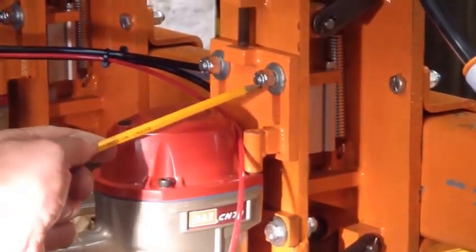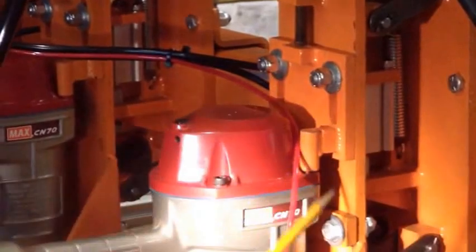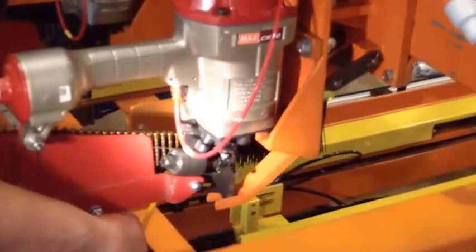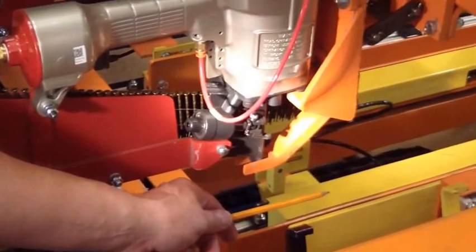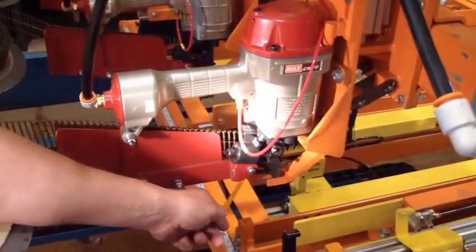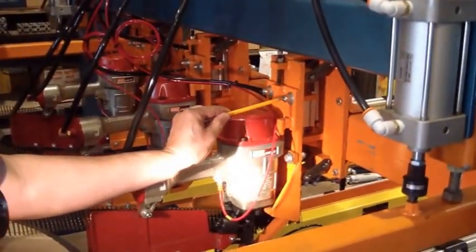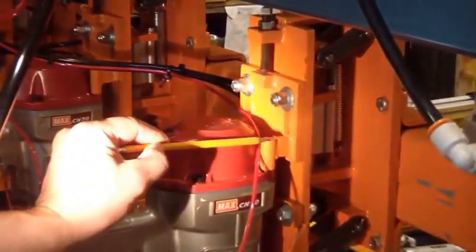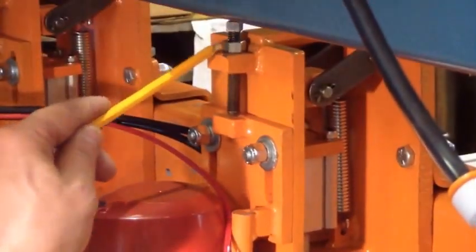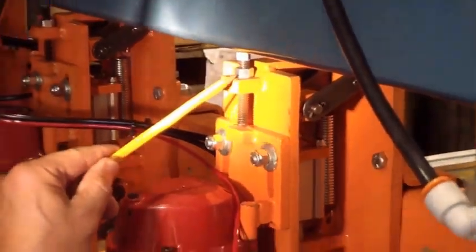These two bolts here loosen up to raise that up to get it out of the holder. This brush right here is mounted right here with 2 bolts. The brush applies pressure to the deck boards against the board stops. That brush needs to be in there and it needs to be flat. When you put it in the tool mount, set it into place, tighten these 2 bolts, make sure it's down and seated on the head cap of the tool, and then slowly tighten the jack screw down. Do not over tighten the jack screw. You will have a problem. And then lock down this lock nut.